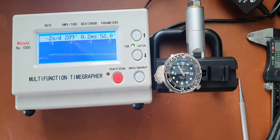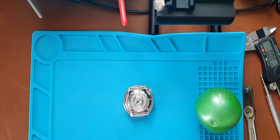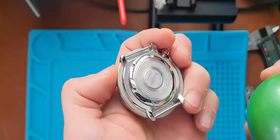As we can see the watch is running actually in COSC area. Maybe I'll ask Mario if he'd like to have it in the plus instead of having it in the minus, which would be a little bit more helpful. So I'm back — Mario was saying he would prefer to have it in plus rather than minus, so I will regulate it accordingly, as it was around minus two to minus three. I'll try to push it up to plus two, or even zero would be perfect.